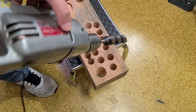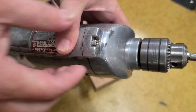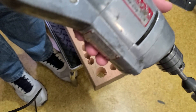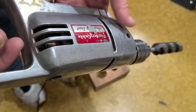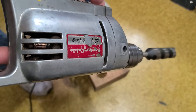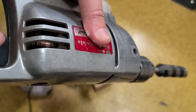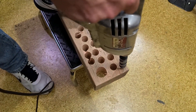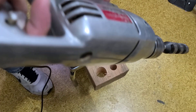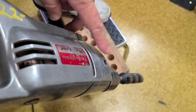We'll do a user drilling demonstration. We've got a one inch auger bit here. I was realizing that this whole boss square odd thing on the bottom of it is maybe just something to grip onto since it isn't that particularly powerful at 3.6 amps and 750 RPM. It seems optimized really to run a half inch bit through steel, and that's really all the grip you need. The side handles are so small and insignificant.